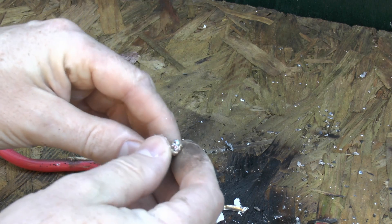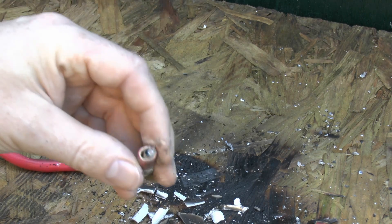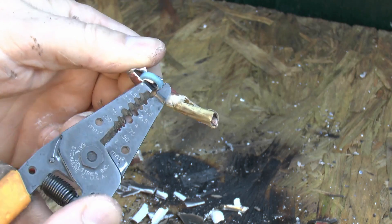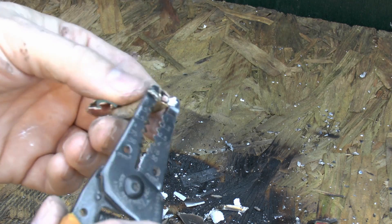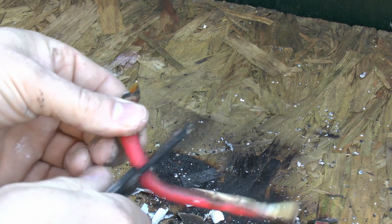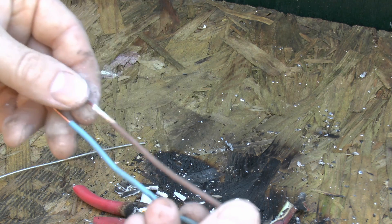This is the other piece which was heated somewhat less, but similar thing — the outer covering is just this crumbly, charred arrangement that just falls away from the inner coverings. And again, if we cut through here, we can see that the inner cores are pretty much undamaged. On the ends, the blue and brown colouring is still visible. This part of the cable, because it was heated less, is still fairly rigid and robust. Once pulled away from the inside, it's pretty much as you'd expect on a brand new piece. Even the piece where we applied the flame directly is still intact, though once you touch it the outer covering does crumble away.